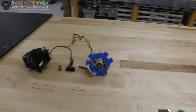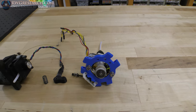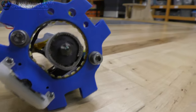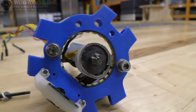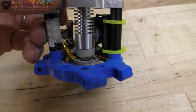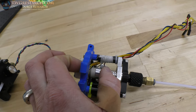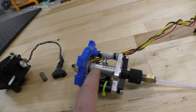Let me show you my extruder hot end. I spent a lot of time making different things and I came to this conclusion. I found this extruder — it's called the UBIS, you can look it up. This is almost a replica of that, but it's just got a few different parameters, such as this dark material you see right there — that is actually copper. So this whole entire piece is copper. There is actually a piece of PEEK in between the hot zone and the aluminum, and the PTFE tube runs all the way down to the place where it hits a copper piece, and then the nozzle. Those two, when they get pressed together, that's how they seal.